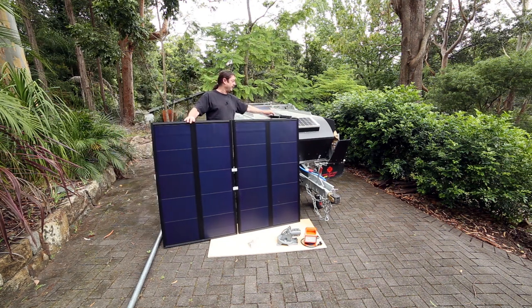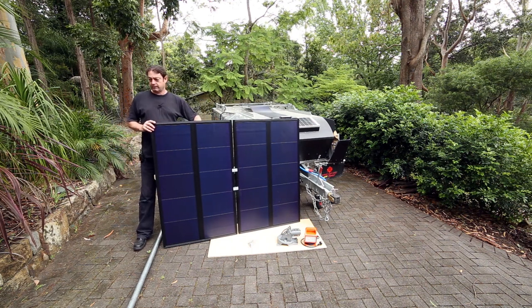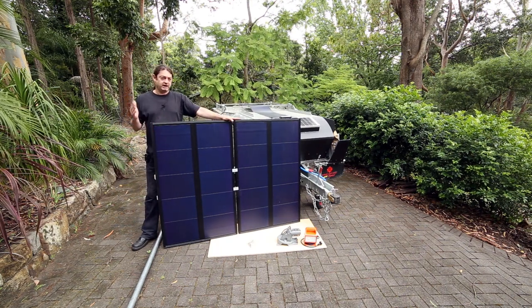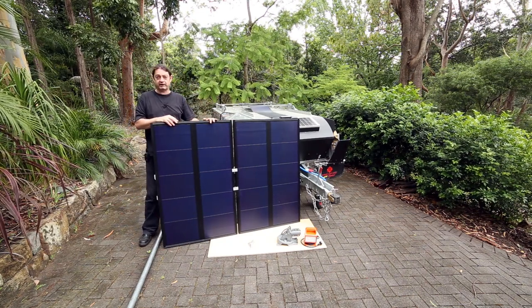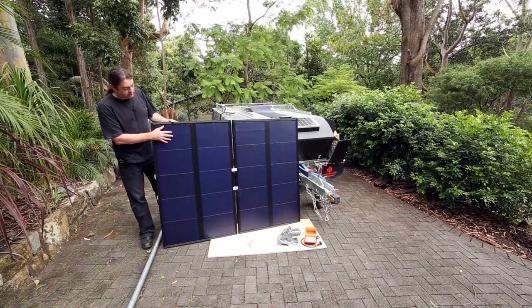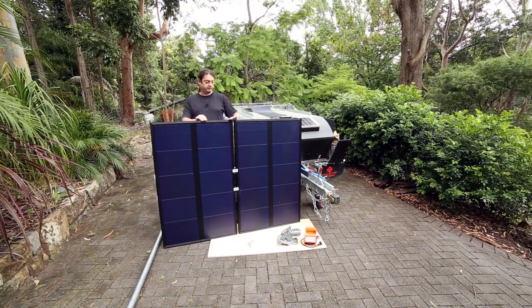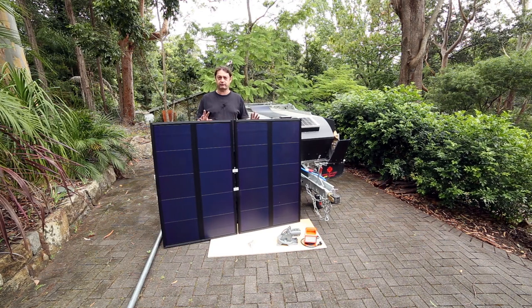This is an amorphous panel here as well — they can actually roll up. But these have been mounted on a piece of thin plastic or polycarbonate. The nice thing about these is that they work well in shaded environments where you get the sun coming through trees. In our case we've got lots of lovely eucalypts and we frequently get shadows cast onto the panels. The panels are divided up into various sections which have diodes on them, so if one panel is shaded the other panel can still perform well. They also characteristically work well at higher temperatures, say over 30 degrees C, and still have good efficiency.